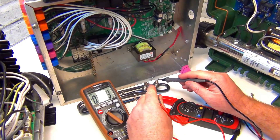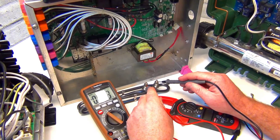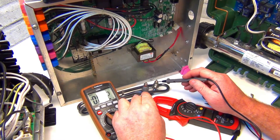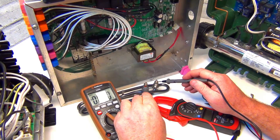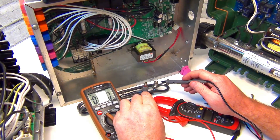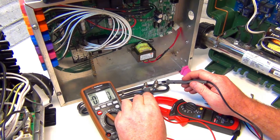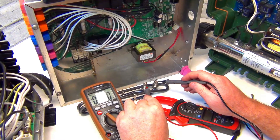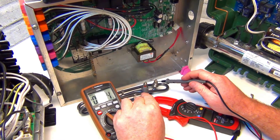When testing your element for voltage, if your tub is 240V you should get around 240 volts. If it's above 245, no big deal. You want it around 240 - it could be down to 233, which is fine. You just don't want zero or 120.